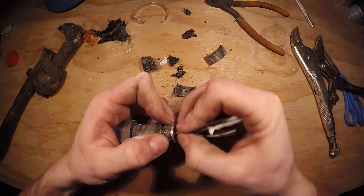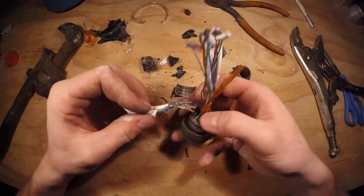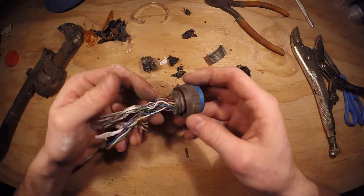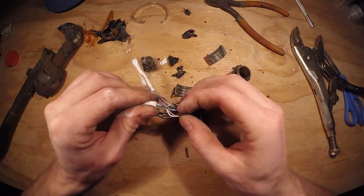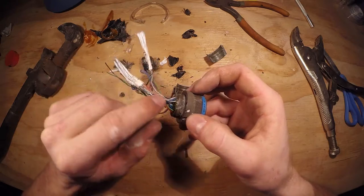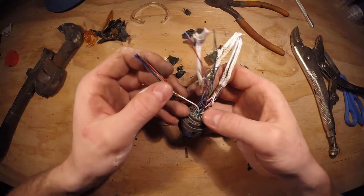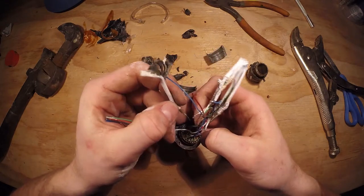Kind of what I thought it was going to be as far as termination — I ended up having to cut it. You can see all the different cables here wrapped in Kapton tape. Everything here is pre-terminated. So I'm assuming that when you get this connector, you get the pre-terminated connector and then you solder everything in that you want to solder in. Some of these wires here have a little bit of a twist to it, so that would imply this was for data — the whole thing more than likely has to be for data. Interestingly, there was a fair bit of power going on here. So this white connector — the center connector — that's W, and I'm assuming Z was this one here. So the two power connectors.